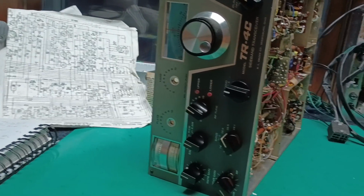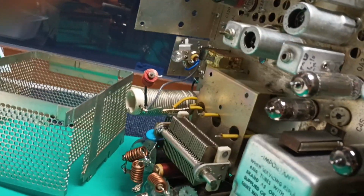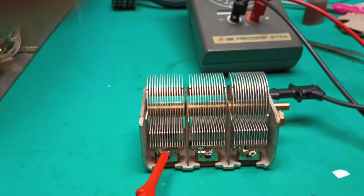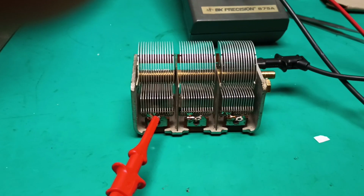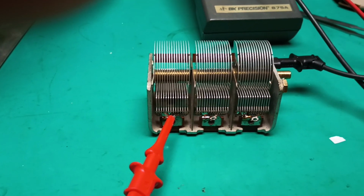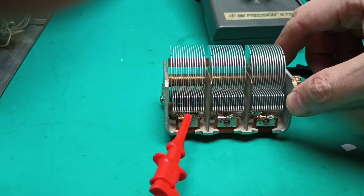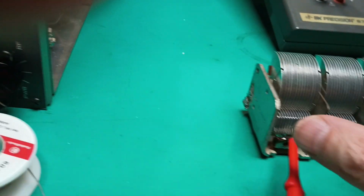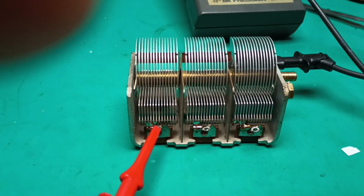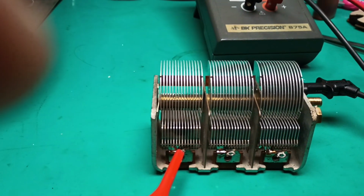there wasn't enough capacitance. Well, a lot worse than that, because there's the hole where I took the load capacitor out. It's broke. And this is a repair that has a butt puckering factor of 9.6, because this is the one part in this whole radio you don't want to work on. Hose this up, transmitter's finished. You can go to Cardwell, I think they're still around, and you can pay $400 for that, but you just wrote off the radio, unless you really like it.